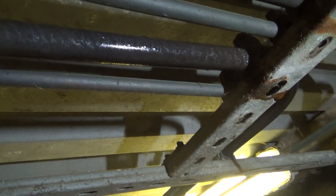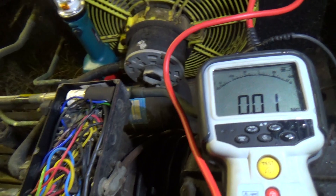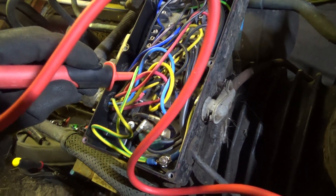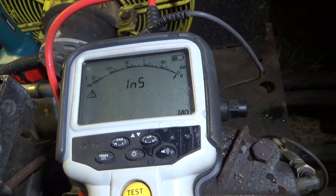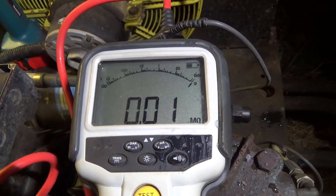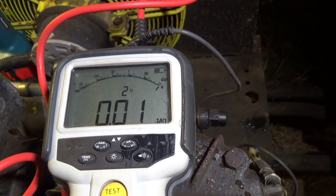One Megger's getting wet here — the pipes, the unit's come over our head so it's dripping on it. So we'll move that over a bit. First thing we want to do is confirm that we've actually got a short. So we'll go on one of the phase wires, on the red phase. That's looking like a short. It's going to be all three, but we'll just do them all out of habit. All three — yep, they're short.